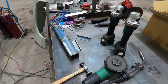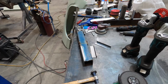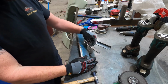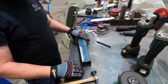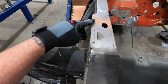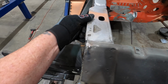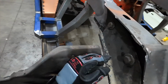So what I'm doing today is similar, where I've got this RHS here, and if you like, this represents the original chassis, and these are my plates which are going to be going over it. What I did to the Falcon is, originally it had seams that stuck up like this. Actually I'll show you, because there's still some showing. Say here, this is an original seam where the plates actually lapped. The original chassis weren't just a piece of RHS, they were pressed steel, and the joins were lapped and then spot welded, so they were like exterior joins.